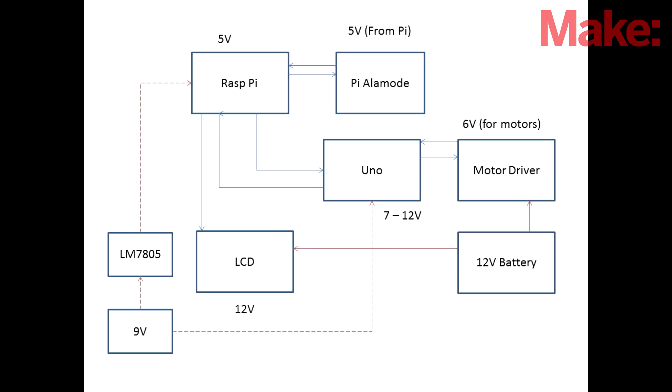The reason I don't just apply 12 volts to a 7805 is the fact that it's a linear regulator and it's highly inefficient, meaning it'll actually have to dissipate most of its voltage drop — from 12 volts down to 5 volts, which is 7 volts — in heat. I didn't really want a little heater inside the robot. Therefore, the 7805 wasn't the best choice. However, the design I had here wasn't the best choice either.